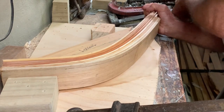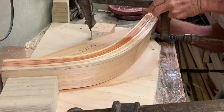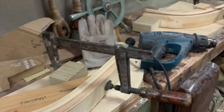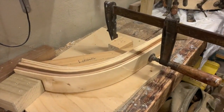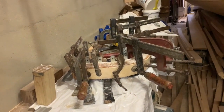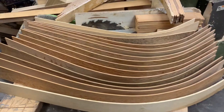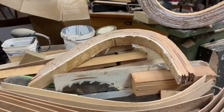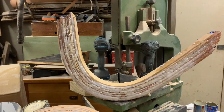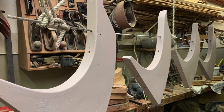Because the laminates were relatively short, I boiled them in a big tub on the kitchen stove. You can see more on steam bending in several of my other videos. After leaving them for at least 24 hours to settle down, I separated the laminates so they could dry for several days, then glued them together with epoxy, then added a backing block which can be a single block or glued up from multiple pieces. Here you can see the assembly line with laminated knees in different stages of completion. Laminated knees can look okay under varnish if they're made neatly and are built up from the one species of timber. I just prefer the look of traditional knees in traditional boats.